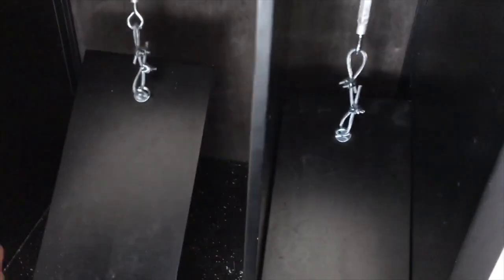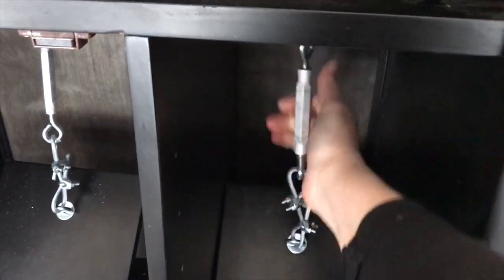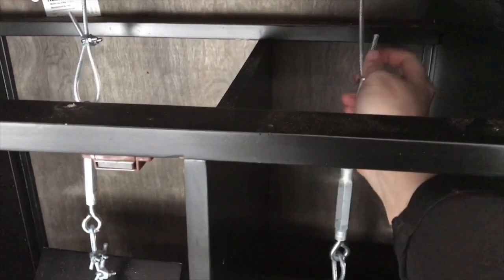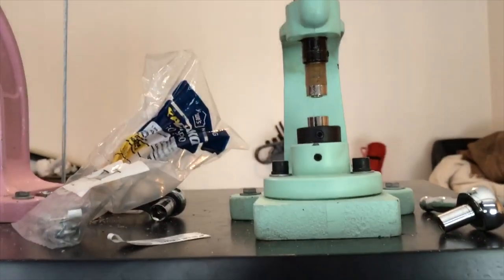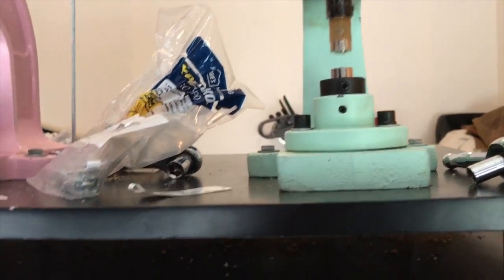Now, as you can see, or maybe, I don't know if you can tell, but this pedal is a little bit lower than this one. Now, it may still work. As I push on up here, you can kind of see. But if there's too much slack, again, you can tighten these, but mine is all the way tightened. So what I may have to do is go ahead and unscrew this and then take this up just a little bit higher for it to have enough pressure to pull down all the way on my snap press up there.